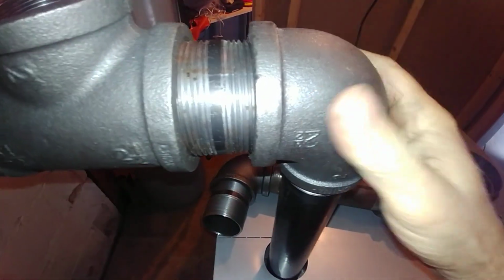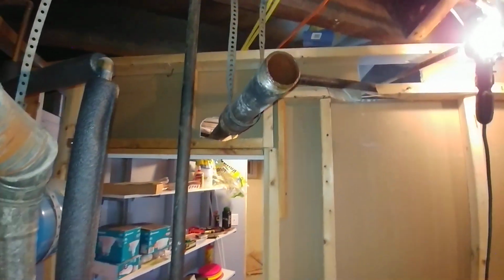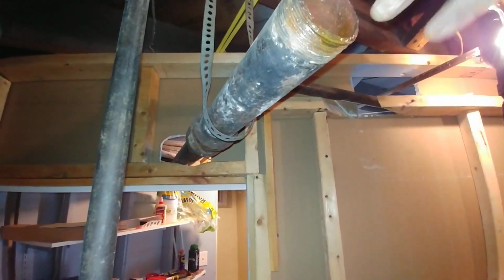Normally we come up and then, as an extra added bonus, although the instructions say we can use 2-inch, we generally go to 2.5-inch because we think that gives drier steam. So we've got that, and then we've got this over here. And this is a counterflow main, so we're going to have to figure out how to put a drip back to the wet return there and make that work.